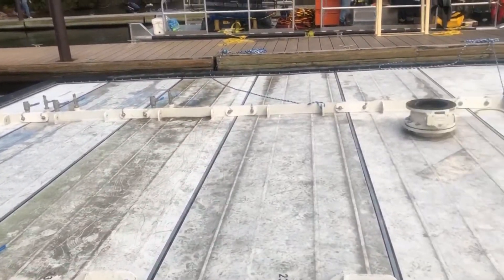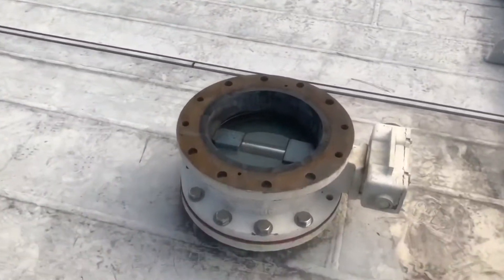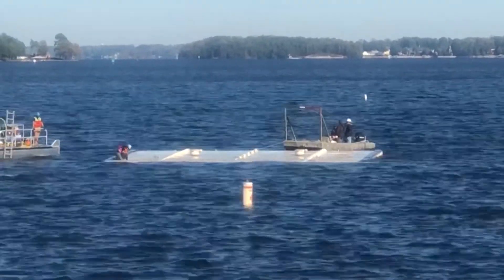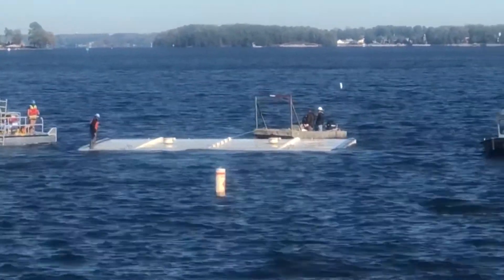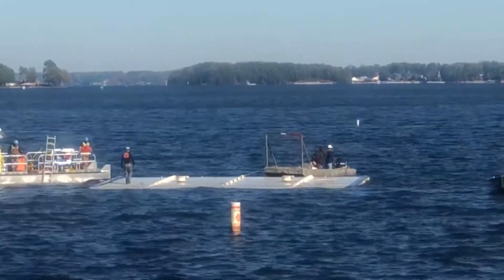The large valves seen here in the third caisson are used for removal of the bulkhead from the spillway bay by flooding the dewatered area between the bulkhead and the spillway. Once assembled, the bulkhead can be moved in the reservoir by towing or pushing with small boats and positioned in front of the spillway bay to be dewatered for deployment.